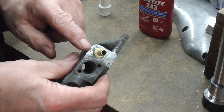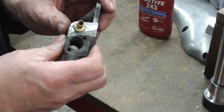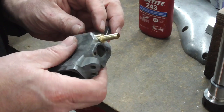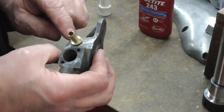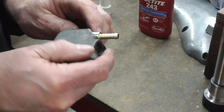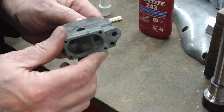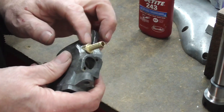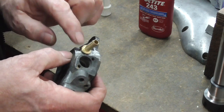To make this look a little bit better I'm going to build it up with something like QuickSteel or Devcon type putty. You may ask why not weld it — well as you can see it's very porous, I've had a go with the DuraFix and that didn't take to it. I don't want to risk doing more damage than necessary on something this old and this hard to replace. So that's the good mechanical fix and we'll do a cosmetic repair round there, leaving a little stub sticking out for the pipe to go on.